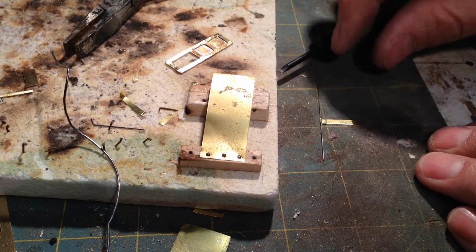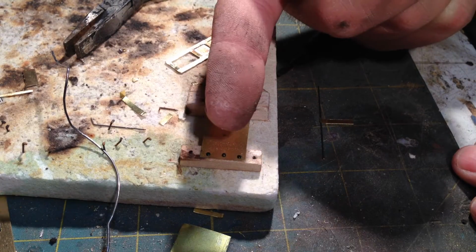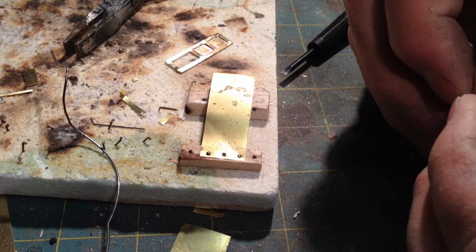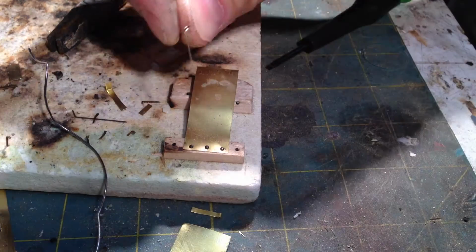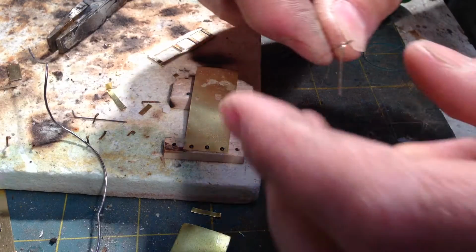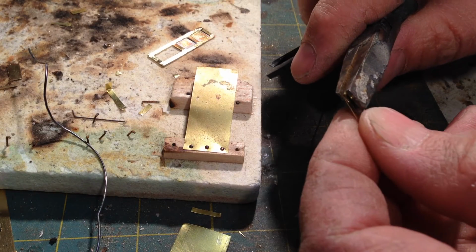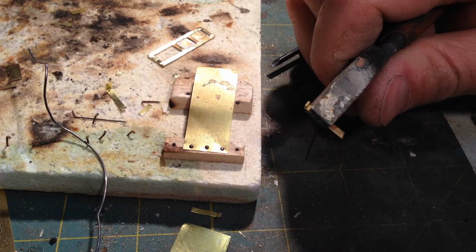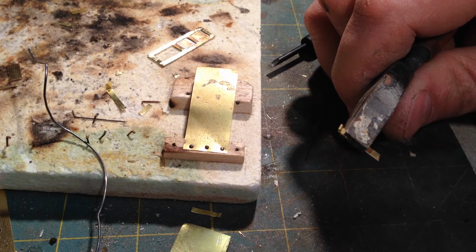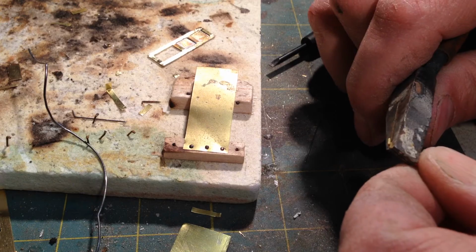So what that does is that gives you the hinge with the flat back, and then the top will roll over and then it comes straight back. It's probably really hard to see, but you kind of see how the hinge has that flat back. Then I take the wire out and grab it with my pliers again, not all the way tight to the loop we just bent, but a little bit back, not too much back though, because we're trying to support it here.